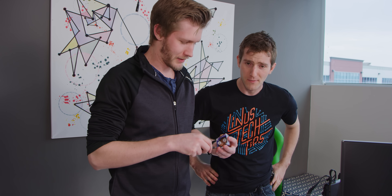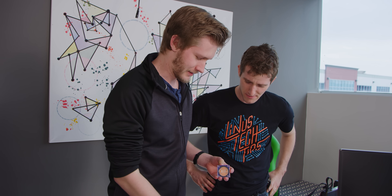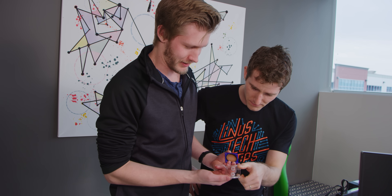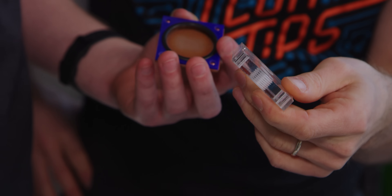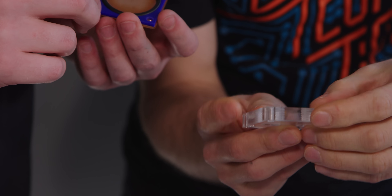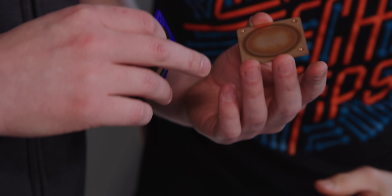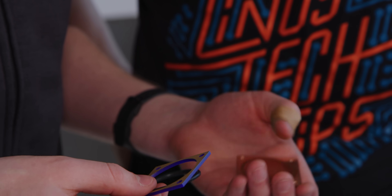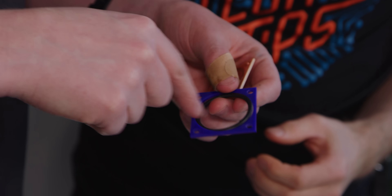This right here is even simpler than what we did — it's kind of smart how they did it. It's really smart how cheap it is to make. If we look, this is just acrylic and it's like six holes and you're done. Six holes, tap to G1/4 threads and bippity-boppity, finished. They don't even bother with doing anything besides holes in the copper because machining copper is a huge pain. So they just have another piece of acrylic that's the right size for the o-ring and don't bother with anything on the inside either.